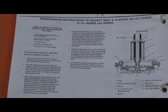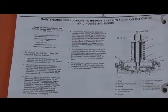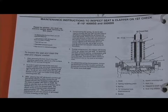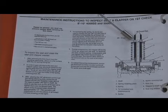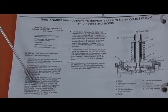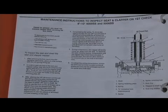This is one of the repair parts that I highly encourage you to read the repair manual. And why I say that, because this spring load is rather severe in the way that it has to be contained for the average repair. It's not released, but it's contained. And the way it's contained is with 2 3/8 all thread rods. You can see the picture of those 2 rods sticking in the picture with 2 double nuts. And what it suggests is that you have a piece of all thread approximately 14 inches long, 3/8 all thread. I'll show you how that works, but I want you to make sure if you get a chance, please be sure to read the repair section on the first check of this assembly so that you do repair it properly without damaging the parts or yourself.